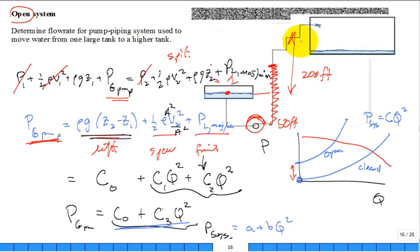No flow. Right? It's like I put this pump into it. It didn't even have a good operating point where it's having a flow. I have to put a big enough pump such that I get the operating point here. Let's say I want the operating point further out. Get a stronger pump, and then you'll move the operating point further out.